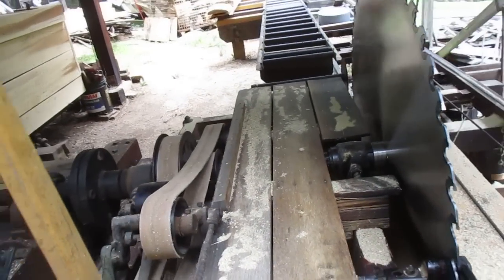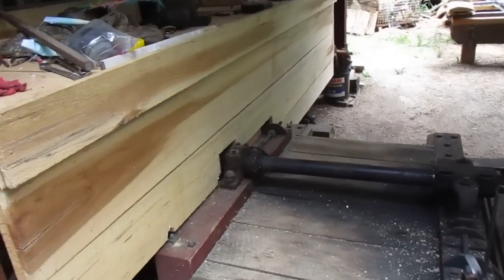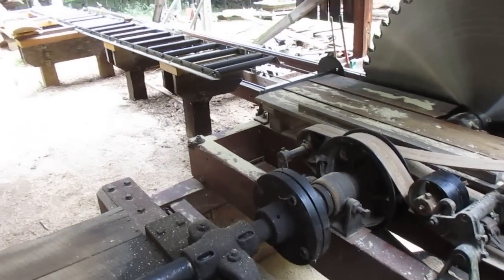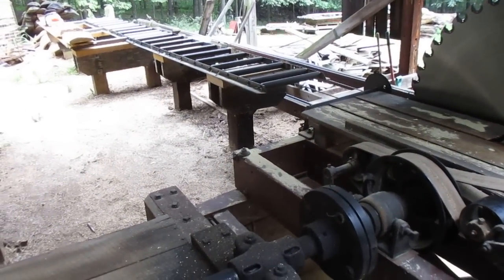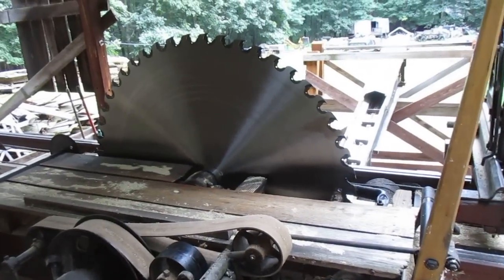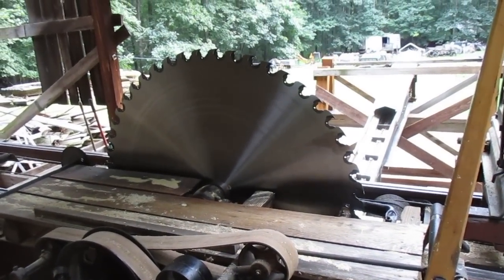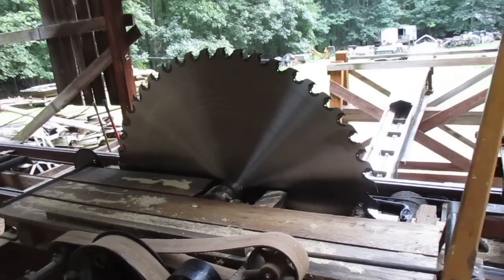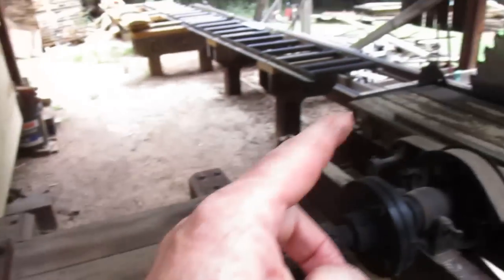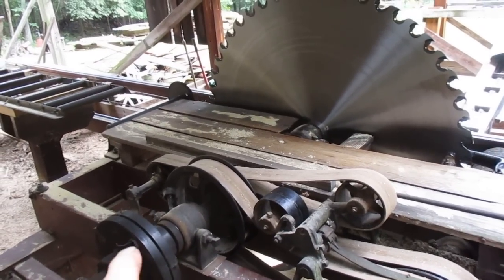Now on the three bearings on it, I've never adjusted one of those right without two people. Do it the same way. Measure that once, measure it twice. You know exactly what you got. Put a dial indicator on it, put the blade exactly where you want it. Then start tightening up. Now you might tighten this one, then you might go back and tighten this one, then you might go back and tighten that one. Leave the middle one loose. The middle one shouldn't be touched.